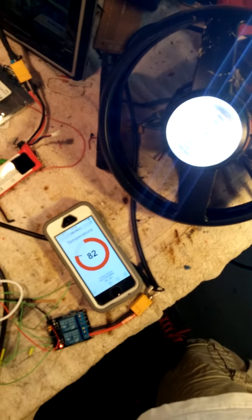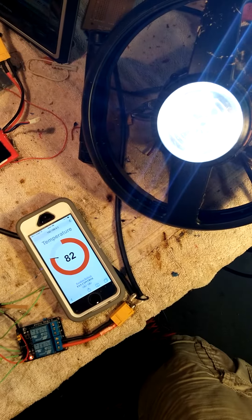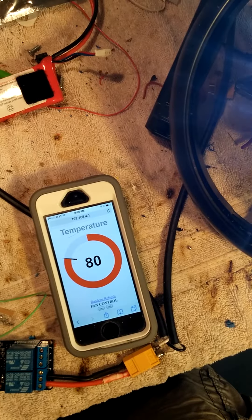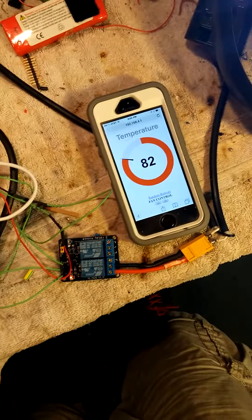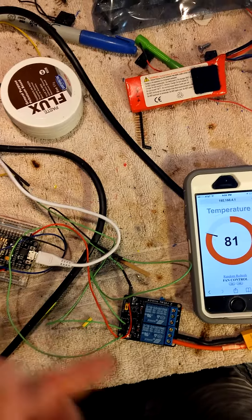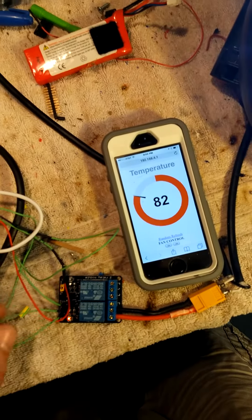I need to increase the size of the button so it's not so hard to press. But anyway, the on button actually sends a little string across the WebSocket over to the WebSocket server, and the code makes the GPIO go low in order to turn this on — to make it close. It's set to normally open.